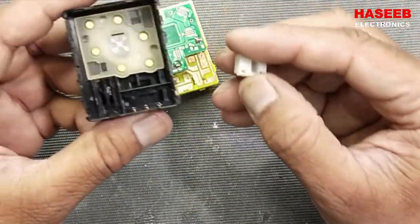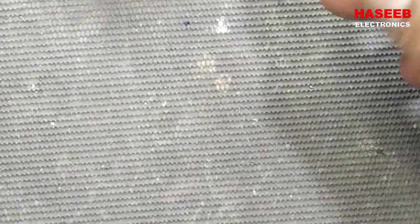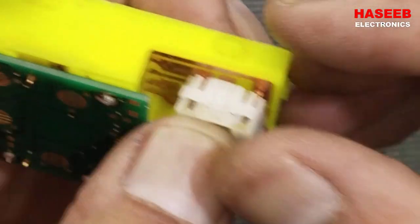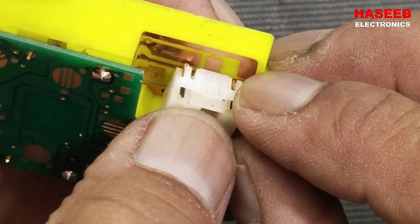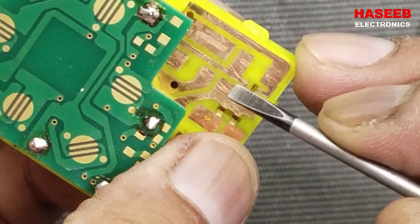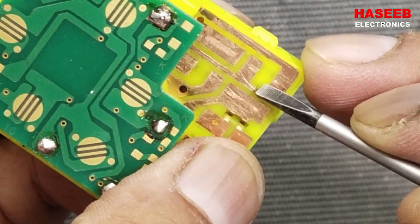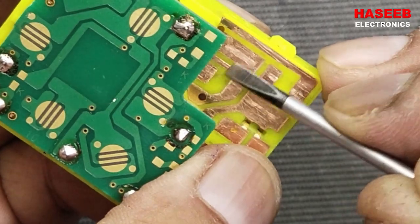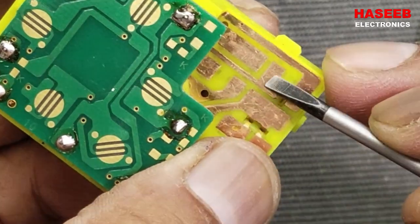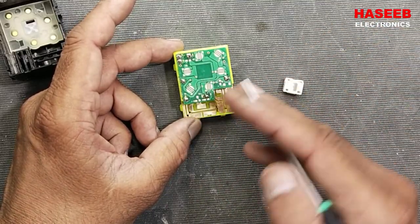Here is a switch. That is the right or left selector. Two contacts, and these contacts make here on the board. If it is in one position, in that condition, this first switch, this switch and this switch make, and at the same time this and this will make. When it comes to the center position, this switch will come to this insulated area and this switch will come to an insulated area. When we move it forward, this point and this point, and here we have these two points, these will make. The output of these switches will go to the right or left mirrors.